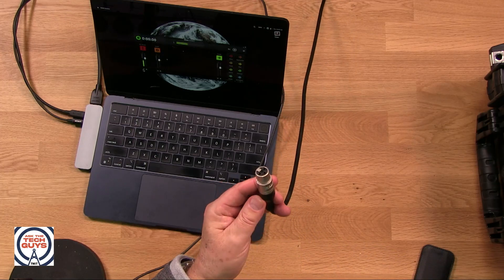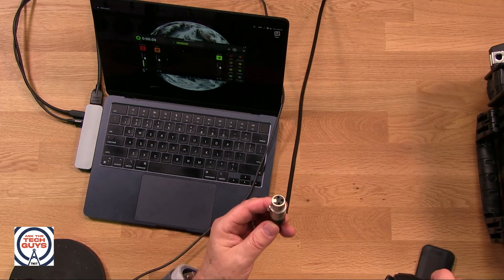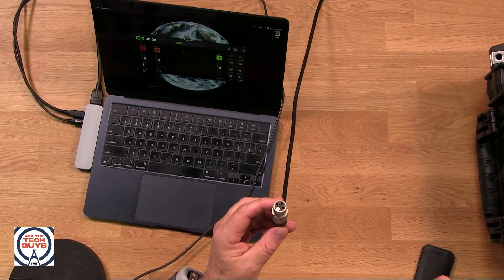This particular XLR is the kind you see on mic cables, but it's not great for podcasters or anybody who doesn't have a mixer. When we set up people for our shows, we send them a Heil PR40 microphone with an XLR connection and a Focusrite Scarlett XLR-to-USB adapter. That's what we call an A-to-D converter, because a microphone is analog and the computer wants digital. We have a Telos Axia system with mic nodes — the analog cable goes into the mic node, which turns it into ones and zeros and sends it over the network into our TriCaster mixer.